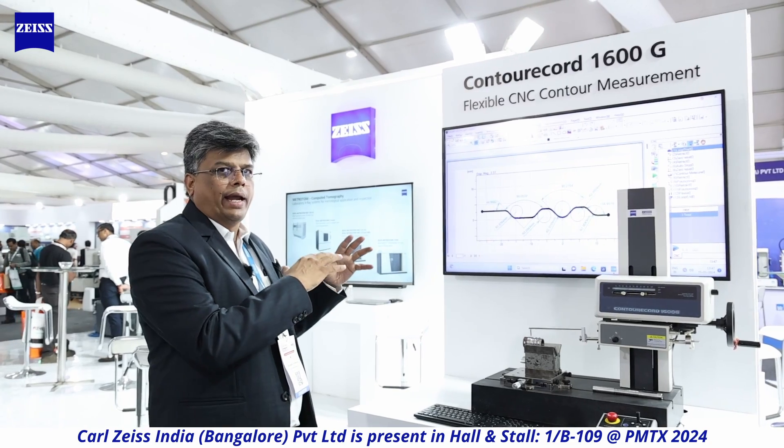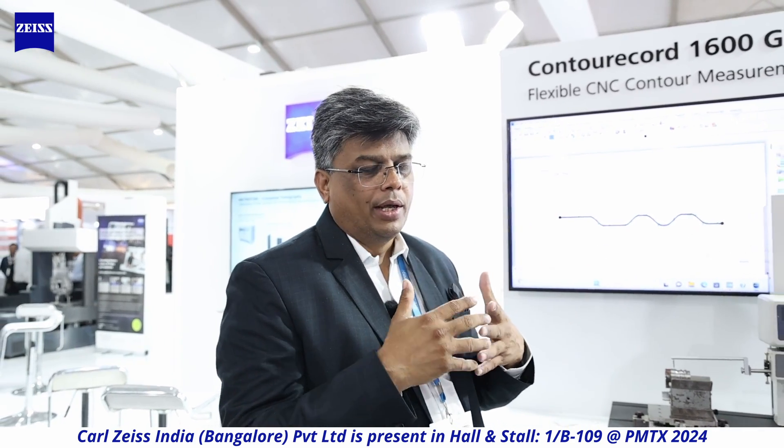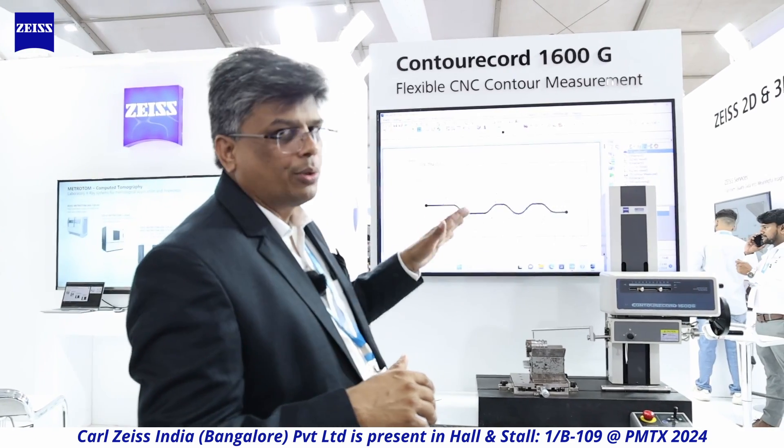Where CMMs end with a contact probing concept, a CMM has a limit because the smallest stylus you can use is around 0.5 millimeters. Here we talk about a stylus tip of 25 microns. When you're dealing with fine chamfers, good surface finish, and refined components, the quality comes from how you finish the surfaces and mild contours. These details create the difference in fuel injection and any interface where there is fluid flow. This equipment is important for understanding root cavities, crevices, and component profiles.